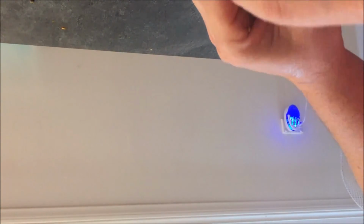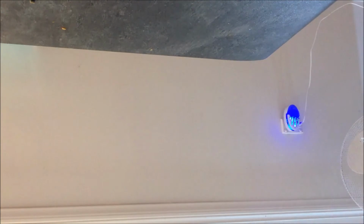It's a bit hard to see the pins in this video, but the pin tops are not flat like in most locks. They're rounded. Round pins make the lock easier to operate, maybe, especially if you've got very bad tolerances, but it also makes the lock much easier to pick and much easier to bump. That's why our bump test works so well, and our lock picking was very easy.